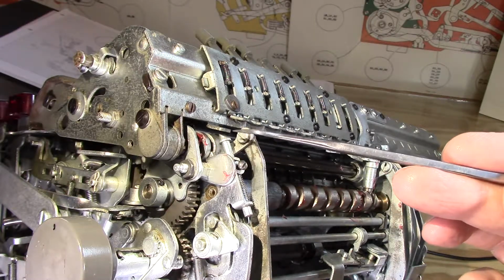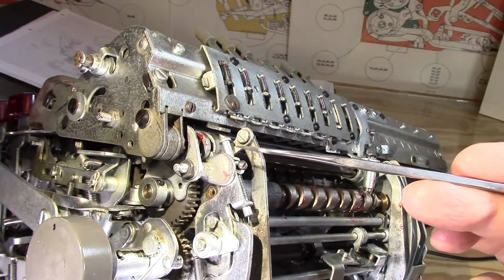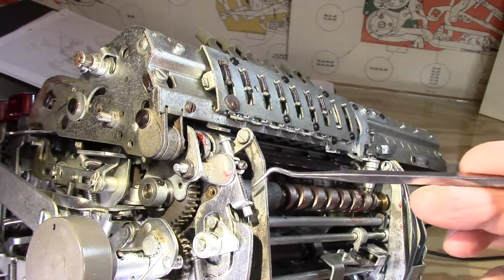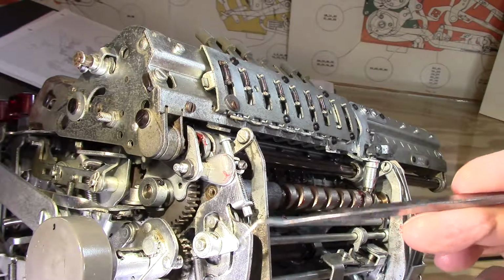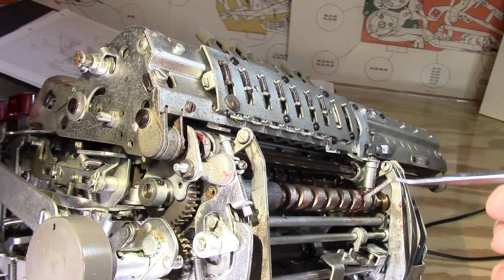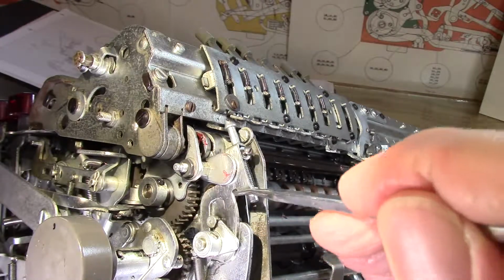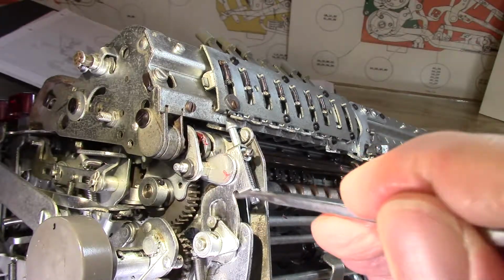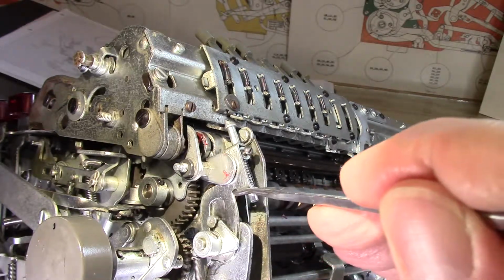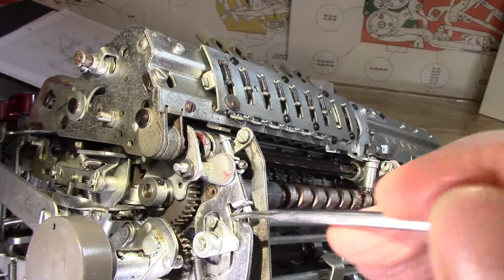And I think what's actually going on is once this guy lifts up and is being moved over, it overshoots, it springs up too much, and that's what triggers it. Because this guy can rock back and forth, and he'll trigger a gear and another gear, and I could maybe show that drawing too. It's interesting how it flops up and down and left and right, and it does a number of different things as it engages against a couple of different other mechanisms. But once the machine's starting, it always deploys up, and then once it reaches something and hooks that, it deploys back down.